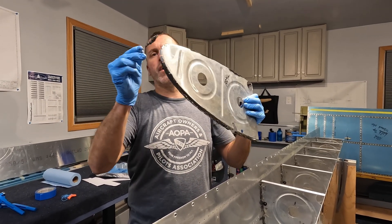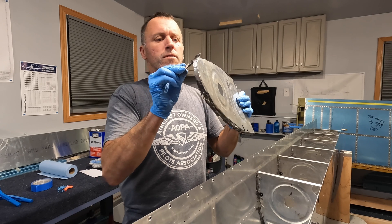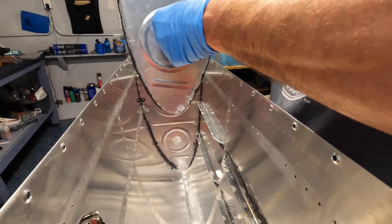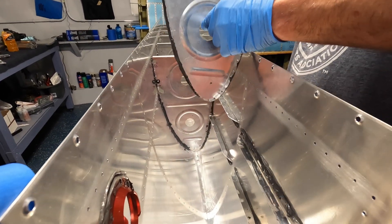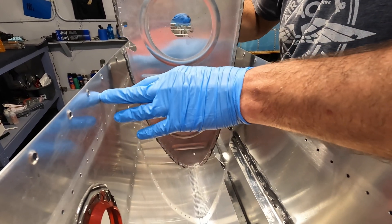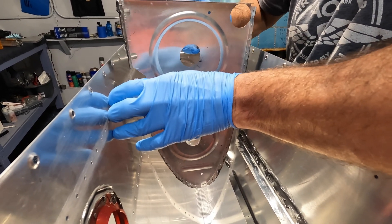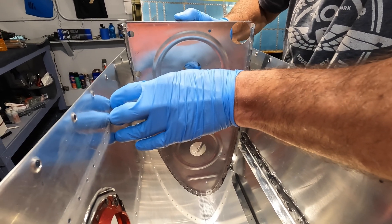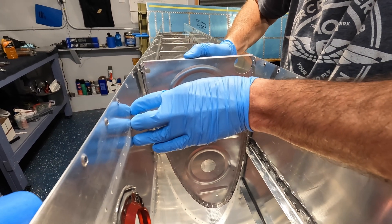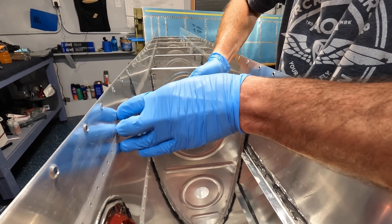Make sure you get the edges and the front to the edge — we're going to just ease this rib down. And since we're getting to the end of the tank it's going to be harder to squeeze this rib in between the skin and not touch the side, so you got to be careful and line it up right along the rib line and drop it in straight.